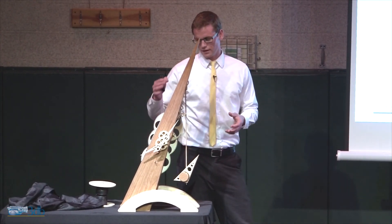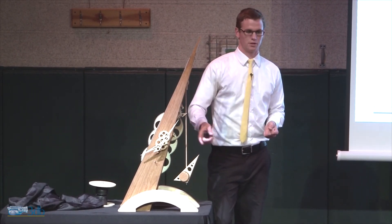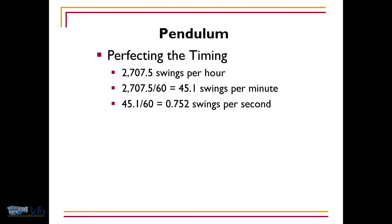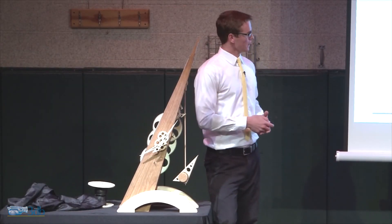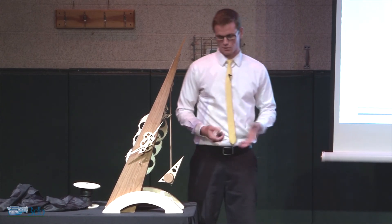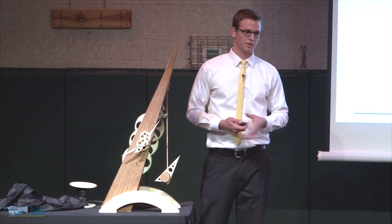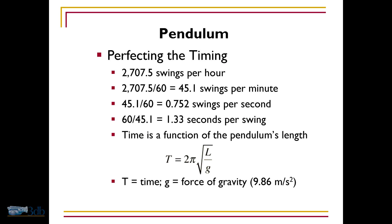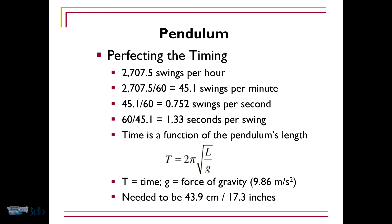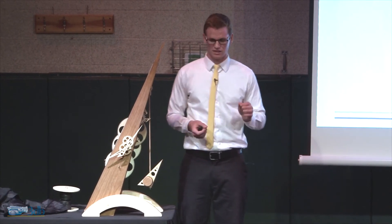Through all that, all the gears are very set and fixed. The only variable is the pendulum and how fast it goes back and forth. As I mentioned, 2,707.5 swings is one hour, which makes 45.1 swings per minute, 0.752 swings per second, or 1.33 seconds per swing. It turns out that time is a function of the pendulum's length — rather surprising, because I would have thought it would be the weight, but the weight is really only for friction. So, like a true engineer, I looked up the equation to find the pendulum's length. Using the equation with time and the force of gravity g, I found that the pendulum from pivot to bob needs to be 17.3 inches. Since I made the clock in Boulder, Colorado, where gravity is a little less, I made it about 17.2 inches.